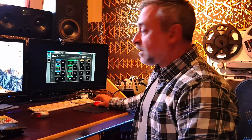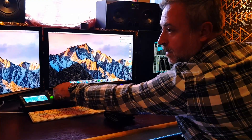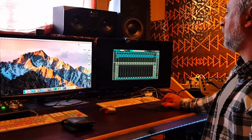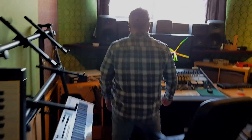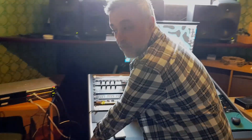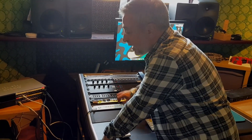The system is clocked at 48 kHz. I have plugged a pink noise generator here on channel one. We can hear that? We can see that this little box is active as well. We go to the other studio and we listen to what happens. So that's the pink noise that comes from the other studio. I will now disconnect and reconnect the VLAN — we are using VLAN 3 — so you can understand for how long the sound would be interrupted.